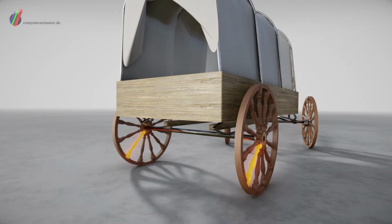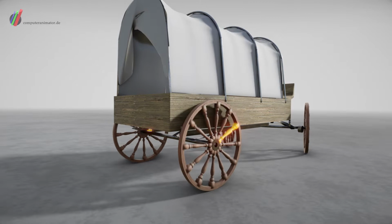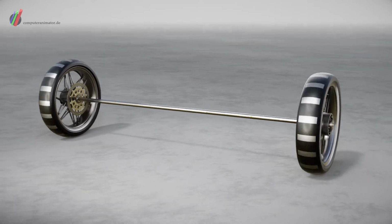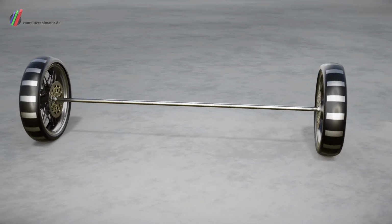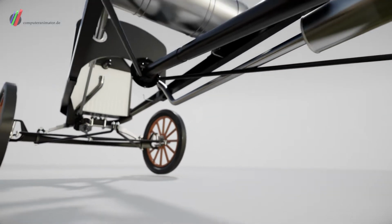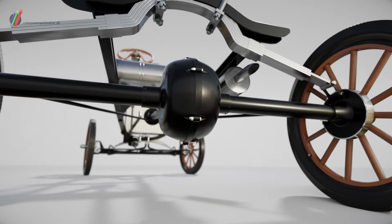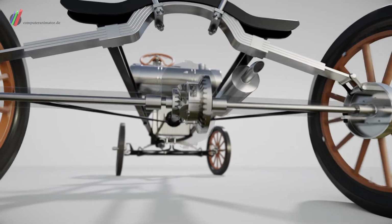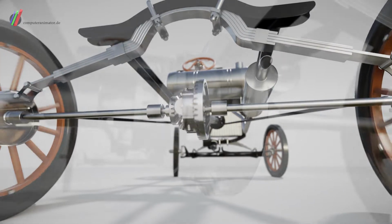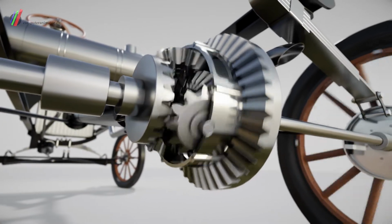When a wagon turns a corner, the wheels can travel at different speeds because each one can turn freely on the axles. But if two wheels are locked on an axle so that they are not free to turn separately, one or the other has to slide. So engineers had to find a way to connect both rear wheels to the engine without sliding and slipping on turns. The device which makes this possible is a part of the rear axle. It is called the differential because it can drive the rear wheels at different speeds.